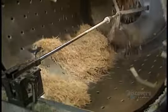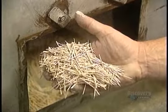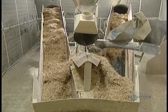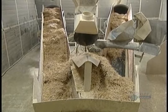Toothpicks exit the polisher and pass through this sifter, which filters out broken ones. Those in good condition continue on to an air blower system. Damaged ones are rejected. Perfect toothpicks are placed onto two conveyors by an air blowing system. Drums at the end of the conveyors assure quantity distribution, then they're carried toward the automatic packagers.